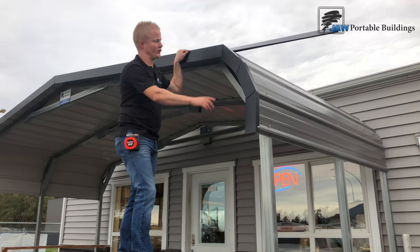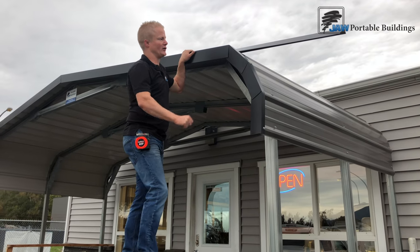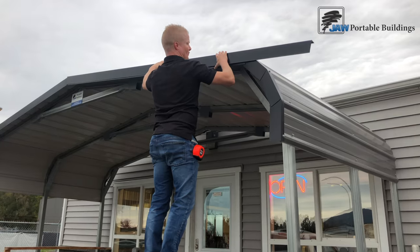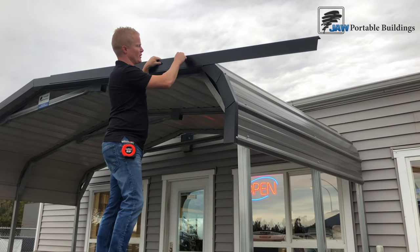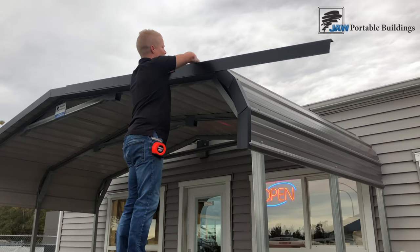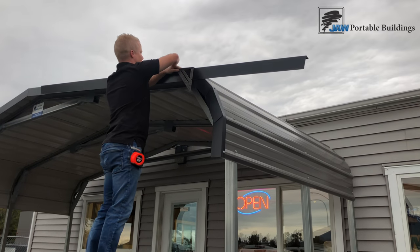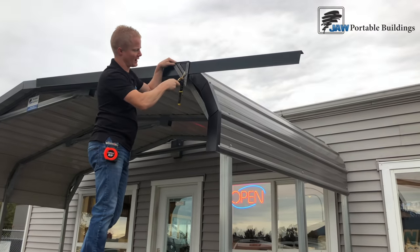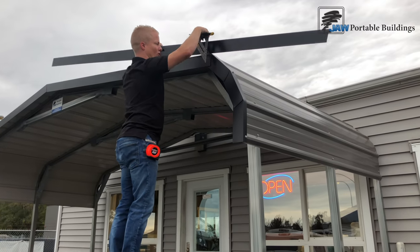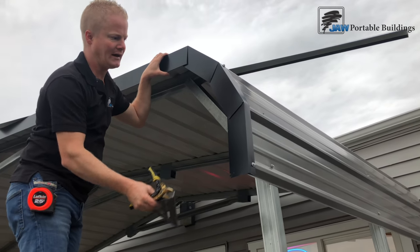So you've got your cladding up. The very last thing is to install your trim — there's zero functional purpose to the trim, it's just for aesthetics. Grab your trim, flush the end way up at the top, and start there. It's going to hang long. Put your screws through the top of the trim through the high ribs on the cladding. To get the bend, grab a square, find that high rib, mark the face of the trim with a pencil, then grab tin snips and cut the face. You'll end up doing three cuts on the face total, and your end result is a trim folded with the long part on the bottom — cut the bottom for length, and that's your finished look.